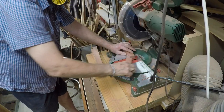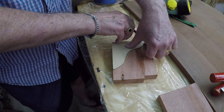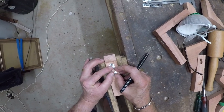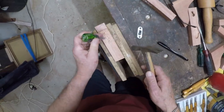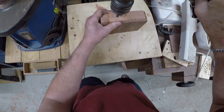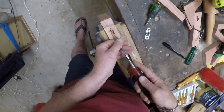Cut to length, then time to think about the curve in the middle. I made up a shape that looked reasonable, had to glue a couple of bits of Jarrah together and cut them on the bandsaw — another bit of video that didn't work — then cleaned them up on the spindle sander. Here I'm tracing out one of those little catches off a door chain onto the side of a bracket piece. I pre-drilled holes for the screws, used a small router bit to create the depth needed to recess it, and finished the job off with chisels and a carver's chisel.